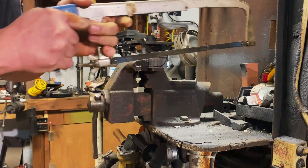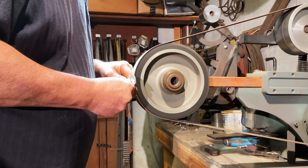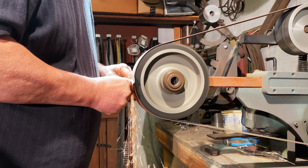You can make a knife with very basic tools. You don't have to have fancy equipment. You can take a file and a hacksaw and make a knife — cut out your blank with the hacksaw, then take a file and cut the bevels. You'll need a drill of some kind to put holes in it for the handle, but it can be done. It'll also let you know right quick whether you want to go more in-depth and buy more tools.